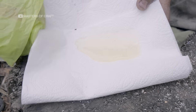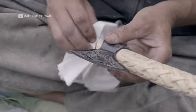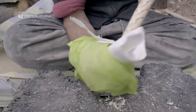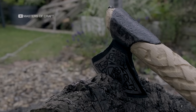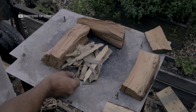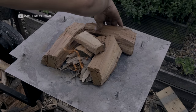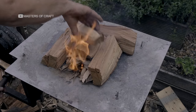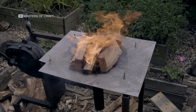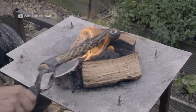Danish oil is applied. This semi-seals the surface and slows down the drying process, meaning it will not succumb to cracks over time. To support this process, we pass the handle through a flame which ignites the Danish oil and allows it to sink deeper into the wood. Charring the timber like this darkens the surface, but also accentuates the carving lines, bringing our handle to life.